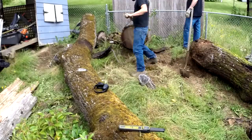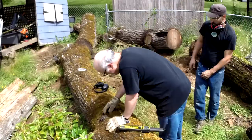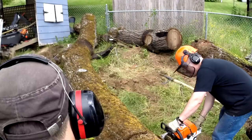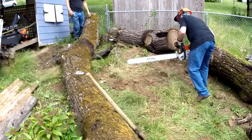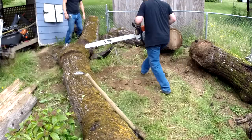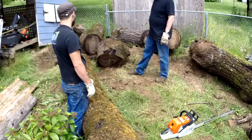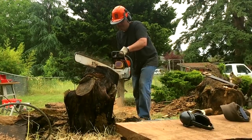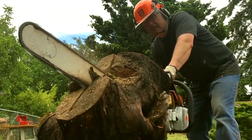Now between two of the pieces that we slabbed, there was sort of an elbow in the branch. And instead of just cutting it off, I made two cuts and I cut out that bend where there was a big knot as well. And I figured I could use that piece as a turning blank to make two bowls. So I cut that in half there on site, mostly so we could move it into the truck.